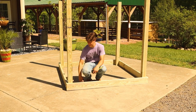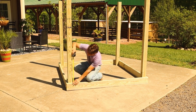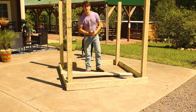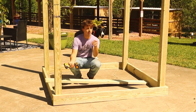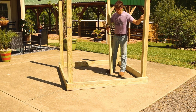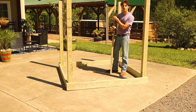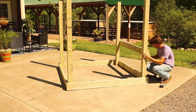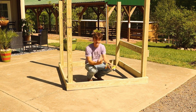I'm not worried too much about making sure they're level because we'll do that with the next set of two-by-sixes. For this next set, I want the space between the top of this board and the bottom of the next board to be about 18 inches. So I'm just going to take my tape measure, go from the top of this board all the way up, and make a little mark with my Sharpie at 18 inches. Also, you'll thank yourself later if you go ahead and start drilling in these screws prior to actually putting the board up, especially if you're only doing it as one person. Your two boards on each side are going to be flush with the four-by-four, and then your boards in the front and back are going to overlap by about an inch and a half. I have the bottom of that board lined up with my Sharpie marks, so I know the space in between is exactly 18 inches.